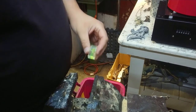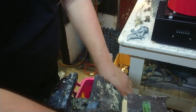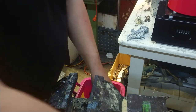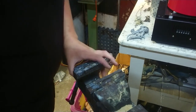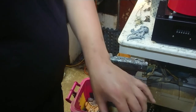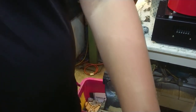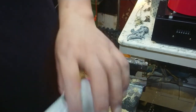I've got a bit of prep work to do and I'm going to spray these assembled molds in a minute. I'm just checking with a spirit level to see if I can get the area where I intend to pour the wax reasonably level so I get a nice flat surface. I did these up tight when I poured brass and haven't loosened them up since. I'll put a packer under here because the screws aren't at the same level, but a known-level packer should get it roughly level.